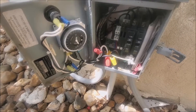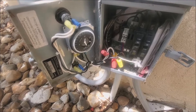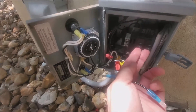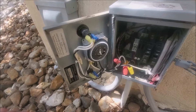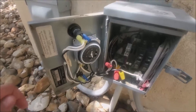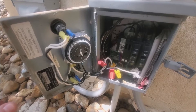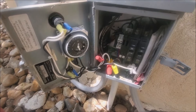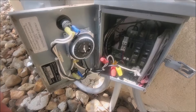A couple of things I wanted to add — I'm filming this after I already replaced the timer. You do want to keep your system running while you're waiting for the new timer to come in, because you want to keep that aerobic pump running at all times. You can just turn off the audible alarm since you already know there's a problem, and just let it run.